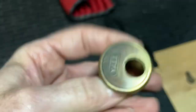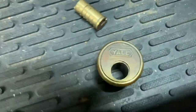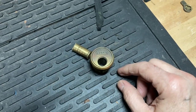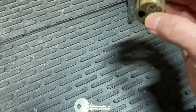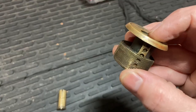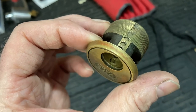You can see how smooth that is — it actually goes with the radius. What is the radius of the cylinder? A normal cap might leave a flat spot. This being like a storefront, you will actually rotate it 360 degrees, so you do have to have something in there. I'll probably use a cap, or use the old ones and just hammer them out a little bit so they're flat, then drive them back in. I have a follower that's pretty snug so I can drive it up against it, or I'll put the key inside just so it doesn't collapse when I try to hammer down. Let me knock these out — I'm going to need small drill bits so I can drill into those, done enough to where I can maybe get an easy out in there. I do have some really small easy outs.